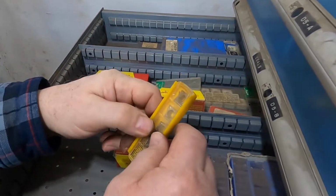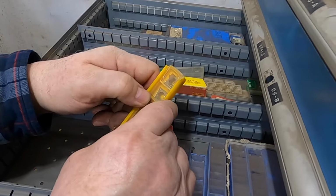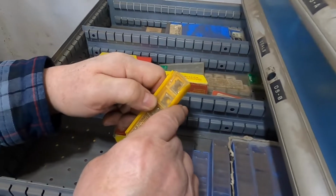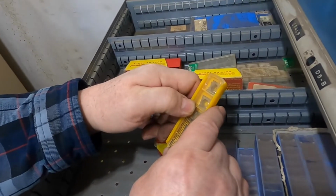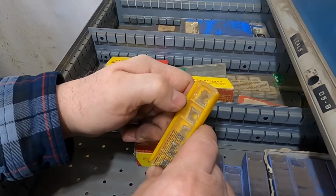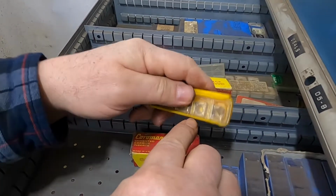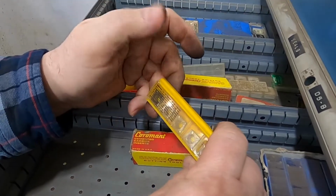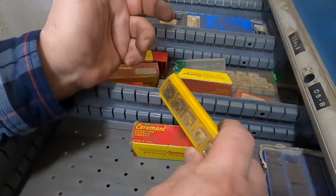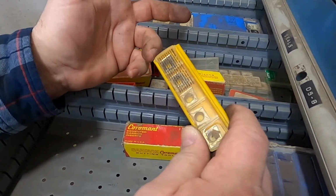The real purpose where these would be absolutely wonderful in a lot of shops is if they made large face cutters. Because a large face cutter, a lot of times you've got a 6, an 8, a 12-inch cutter. You're not coming up to a shoulder. Those are a lot of times just flat surfaces that you're blanking out. And this would be a beautiful one to use, this edge without all the clearance, to just let it cut. It would cut for a long time with the lead-in angle, a lot like a square, which is a common one to find. They'll use a square one the same way, but on the square one now you have 4 corners you could use. Right. So this one we have to first wear it out on the lathe before we decide to use it on a mill.